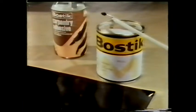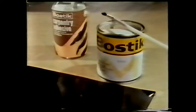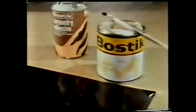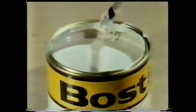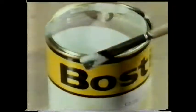What is known is that a very strong bond can result - that took a force of 200,000 newtons to shear it. To make a successful bond, several factors must be considered. Here are two types of adhesive. On this plastics material, one adhesive collects into globules - it doesn't stay spread out on the surface; we say it doesn't wet. Let's try the other one. This remains as a brushed-out film - it wets the surface. This is one of the factors necessary to produce an effective bond.